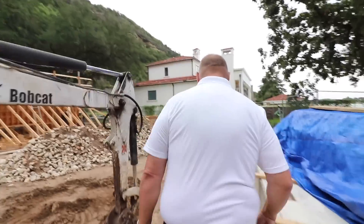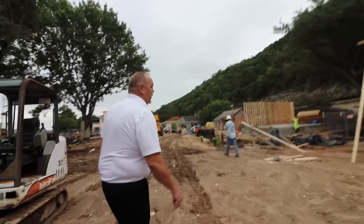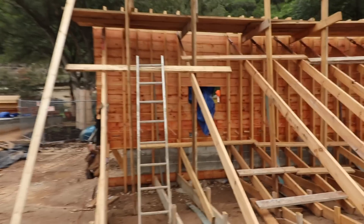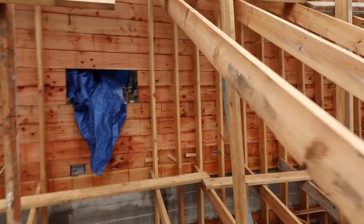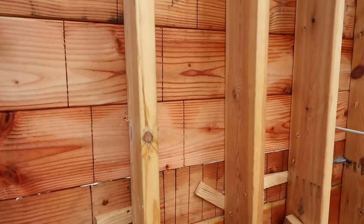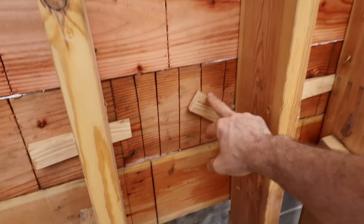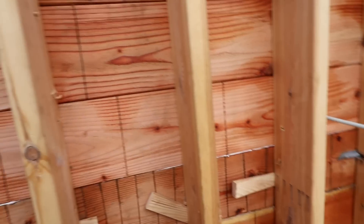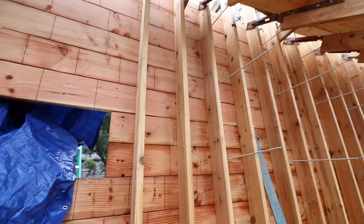I wore my mud boots today. So show me those curves, Brian. Yeah, in both directions. Okay, I see it now — I was missing that before. That's how accurate the patterning is. So to keep the bend, you don't need a lot. But occasionally you'll get a board that's tough and doesn't want to bend and you'll have to add some more kerfs. So this board right here, maybe you've got a kerf every inch and a half — that one was pretty stubborn. Whereas this one above here, you've got a kerf maybe every nine or ten inches. It's all about the graining and the actual wood.